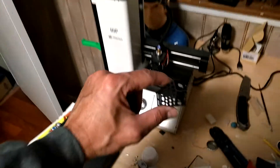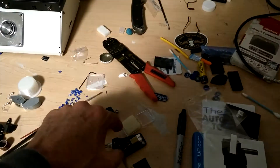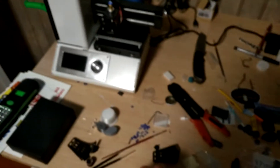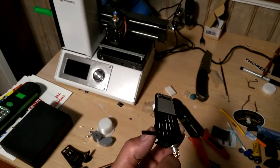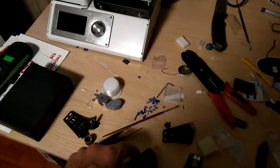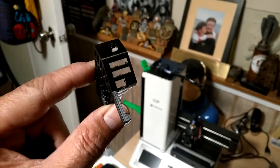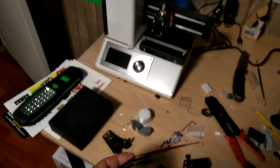I made an original prototype and three variants based on whether you can get the finger lifter device. On the original headshell, the finger lifter is made out of metal — you can see it right there. They fetch ridiculous amounts of money for those too, just for a little sliver of steel. Rather than source one, I extruded a finger lifter directly from the PLA plastic, and it works really well.